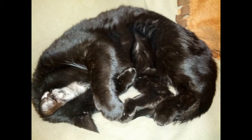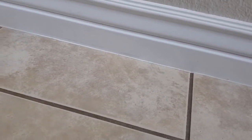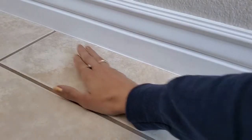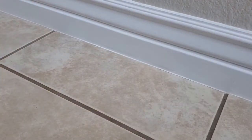Number four: feel the floor yourself. Many water heaters are automatically set to 140 degrees Fahrenheit; 120 degrees is another recommended temperature for energy conservation. Even without a pet to locate the warm spot, it's easier to find a hot water leak this way compared to a cold water leak, where there's not much temperature difference from the water leaking below the slab.